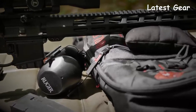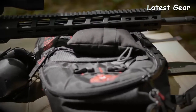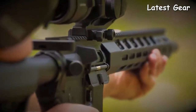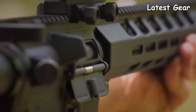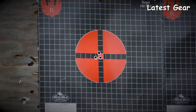The heart of the AR556 build is its barrel. Cold hammer forged from chrome moly steel, it's forged with minimum bore and groove dimensions and 5R rifling. 5R rifling distorts bullet jackets less, fouls more slowly, and cleans more easily. This barrel is forged with a 1-in-8 twist that will stabilize just about any bullet length, and the 18-inch length gives a little extra velocity boost over the standard 16-inch tube.